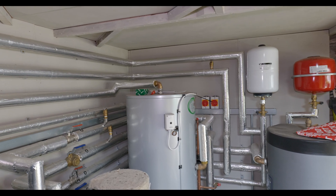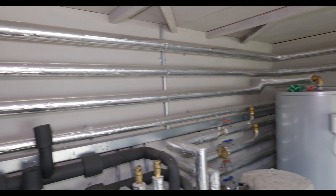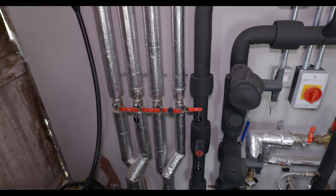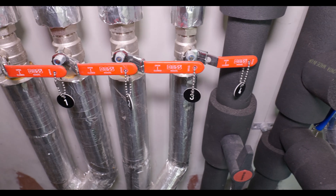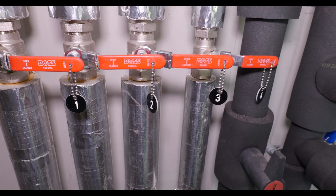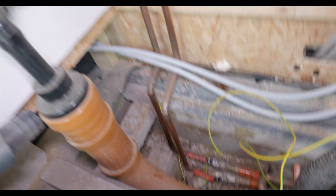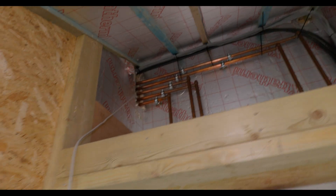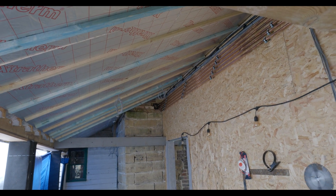The cold water is all live now and that seems to be fine, so we're on to the hot water. I'm just following this pipework back on the top of the unvented cylinder and I can see it's just isolated down here where it goes into the ground, so once I open these up it should send it all the way through to below the manifold cupboard where we've got it isolated. I want to say how much I appreciate these tags on the isolation valves - they all correspond to a plan I've been given and it's really good. I've got the water on in the barn and opened up the isolation valves at the bottom of the manifold cupboard, so this pipework is now alive with no leaks. It's now alive to the point of entry where there are two 15mm isolation valves inside, which will allow me to fill up the bathrooms.